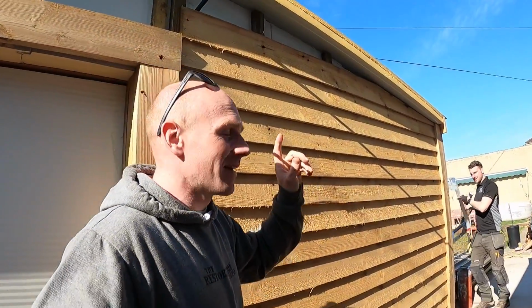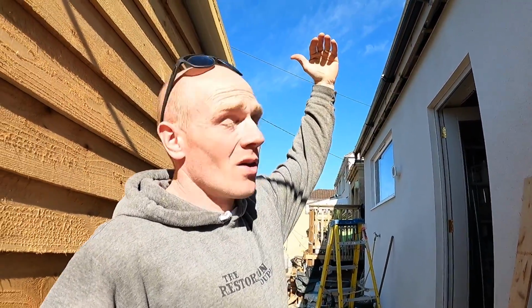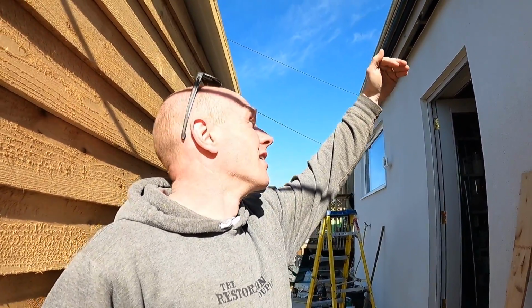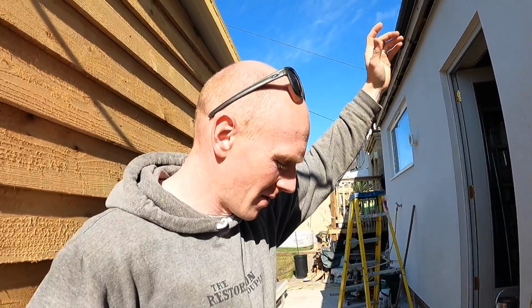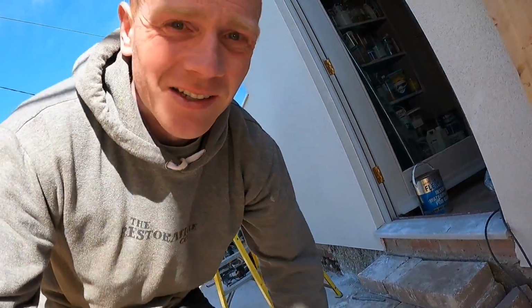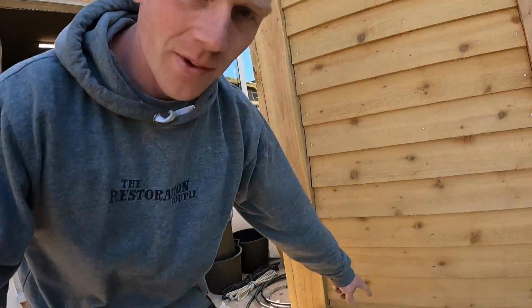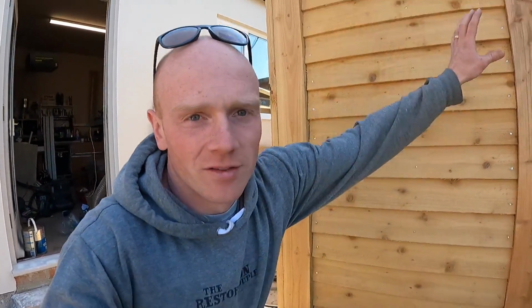So far, so good. I think everything's going to plan on the outside. The supply is coming in from the house. It's coming in currently up on the fascia board, or just below the fascia board. When I redecorate that, paint it and trim it, then I'm going to move it under. But that's the armour cable. We've got 10 mil. It's chunky stuff. It's kind of like as thick as a garden hose, and fortunately we've routed it in underneath. Is it in now? Is it up? Yeah. Cool. So it's coming along and up and into our consumer unit that side.